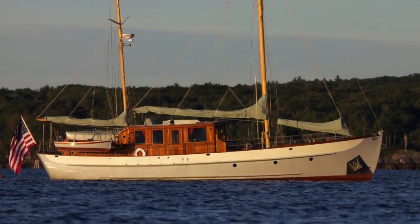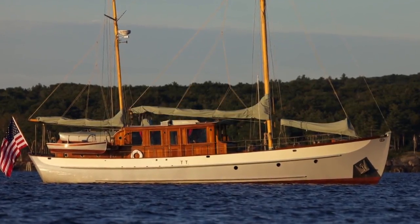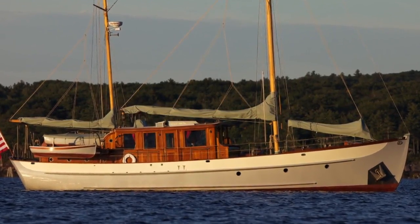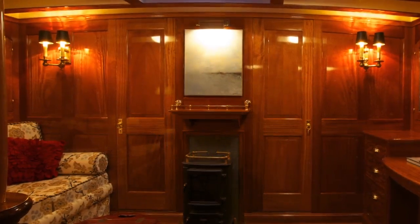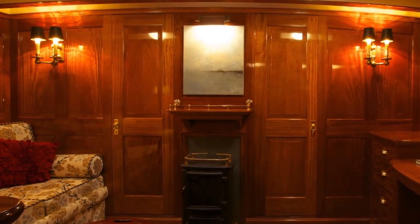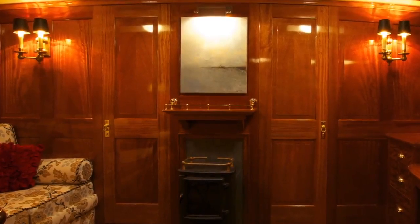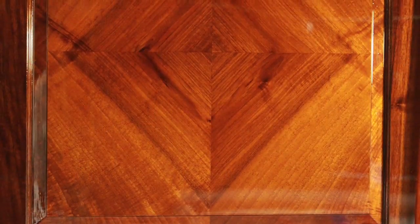Okay, we do raised panels with wood because wood's a natural material that expands and contracts with the weather and the humidity. So if you have a solid wood panel that's glued up and fixed on both ends, it'll crack down the middle at some point. A raised panel in a rail and stile system holds the panel suspended. A rail and stile system allows the panel to move back and forth and yet be securely held by the rails and stiles.